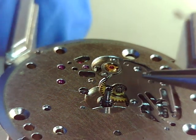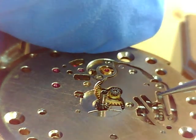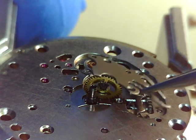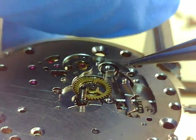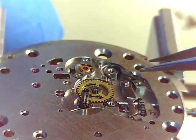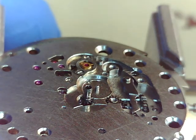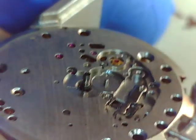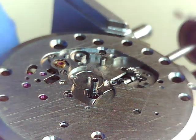There are those three little tiny screws — great to pick up with the Dumont tweezers. This is just kind of popped in there, we're gonna give that a little tweak with the cheaper tweezers and that comes out. There you go — the keyless works. Right here we have that spring, and if you don't keep an eye on it and cover it, it's gonna take off and you're gonna be lost without it. I just put my finger over it, release it, and pick that up. There's another wheel here — I don't know what it's called but you get the picture, and then we have one over here. Keyless works — I know what that's called, I don't know why, I just do.